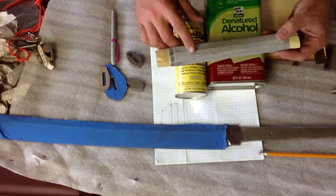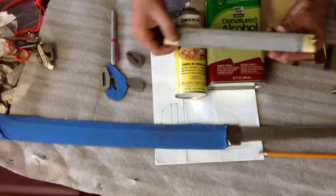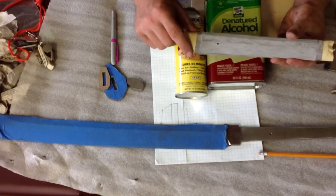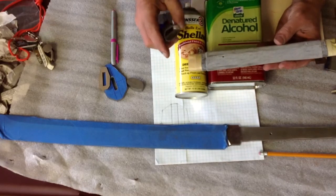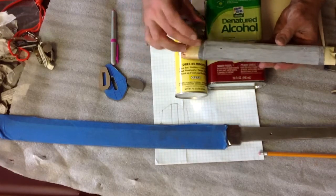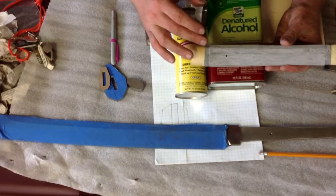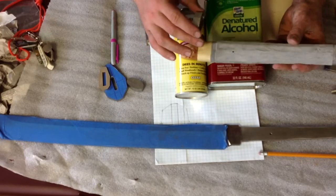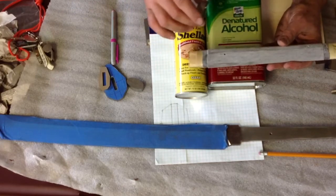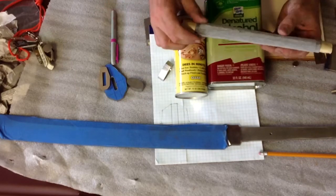So I'm going to spray the shellac on and build up layers. I have it taped off. I have everything filed down. I actually set up and basically for the last couple of hours filed everything down so I get the proper recesses. Once I put these pieces together, I've measured out how thick my cord wrap is going to be, how thick my Turk's head knots are going to be, and so each thing is recessed so that it'll have a continuous flow,